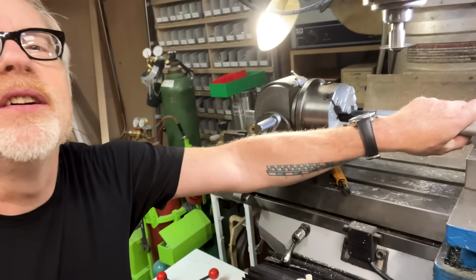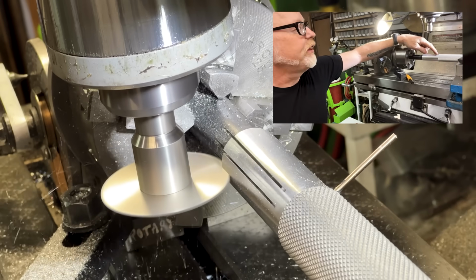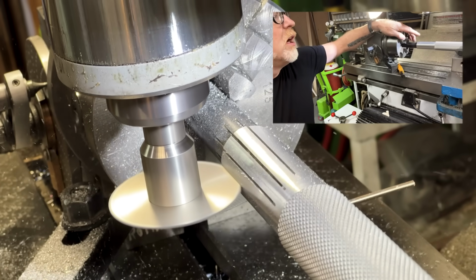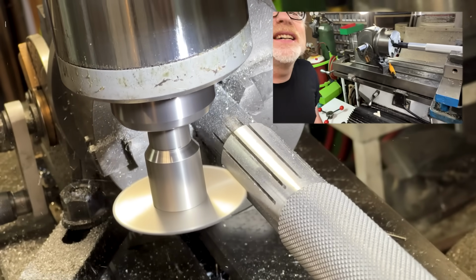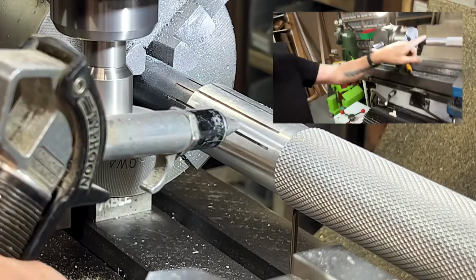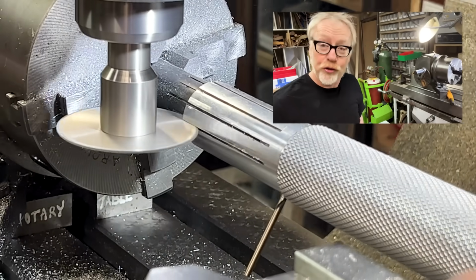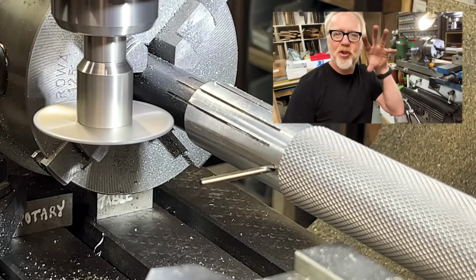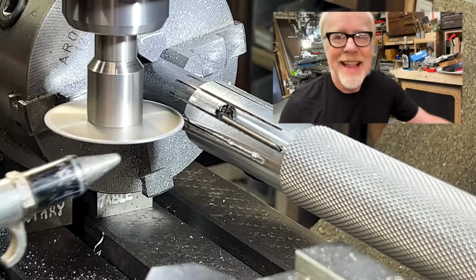Here is the handle. Here is the blade. This is just for visual purposes, because what I have to do is drive a little pin in here to secure the blade handle to this Delrin hunk that I've got here, and that will allow me to hold on to this while spinning and cut into it without hurting the blade, because it's a plastic buck. And what I'll end up with is, I think, a set of 12 leaves that are going to be this long. And the emitter will actually fit over this and clamp into any given 6 of them with set screws, and that will provide a very gentle, I'm building a collet. I'm building a collet for my lightsaber blade. Yeah, that's how I'm doing it.